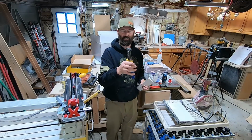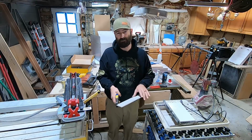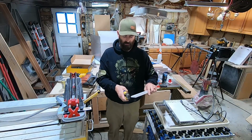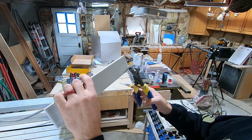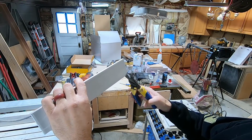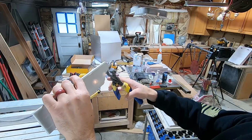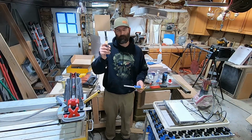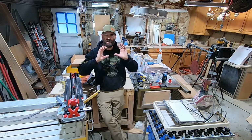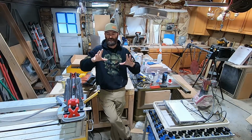This is another tool. It's called little nippers. Get in there. So I'm going to show you how this works here. You can be nipping some tile and all of a sudden a poof pops in a crack and your tile's gone. So say you had an outlet that you needed just to break the corner off of or work your way around. You just take a little bite, just a little bite at a time. Get crazy with it and nip all you want. These two, the nippers and the file, you can do some good work, especially when it's going to be covered by an escutcheon in a shower or a plate around an outlet.